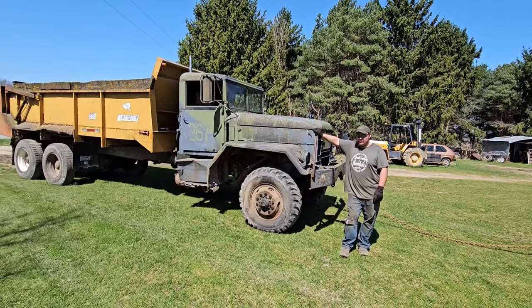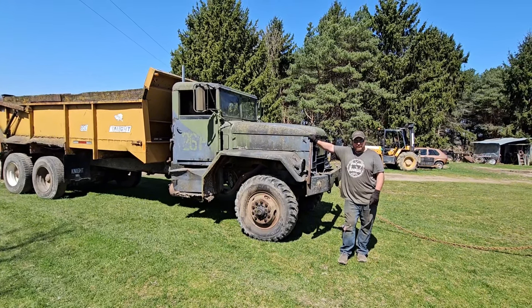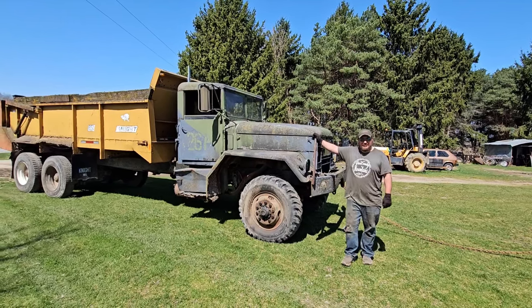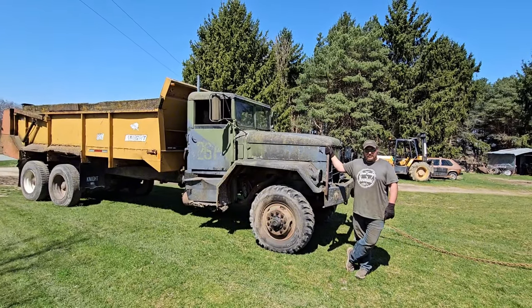The rotor was really messed up and everything. And then I think the points that were in there, they were really cheap. Contact on one side of the points. It was kind of like a cheap set of points, wasn't it? No, we put the cheap set in it. The set that was in it. I thought the ones that they put in it were kind of cheaper and half worn. It wasn't wearing square, was it? It was kind of off a little bit.